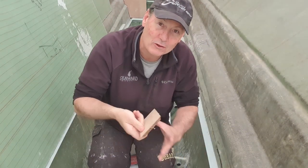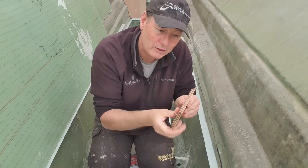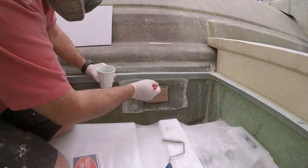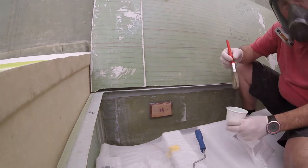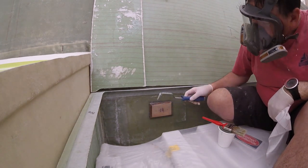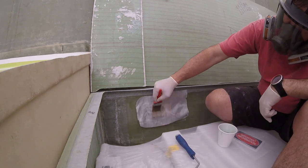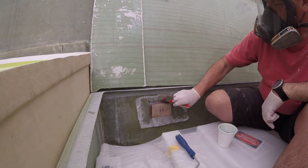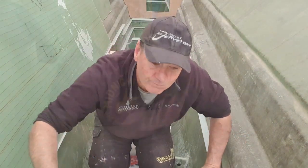Basically, a good way to mount them is I smother it and basically soak it in epoxy, and then I'll screw it in place into the foam core. Now, fortunately, I have 30mm foam, so I can put a small self-tapping screw like this into the foam, hold it in place, remove the screw, fill the hole with epoxy, and basically it's done. And then I'm going to have to laminate over the top of all of them. Now, I've put in four in each fuel tank compartment just for future use. I have no use for them at the moment because everything else is above this particular compartment.